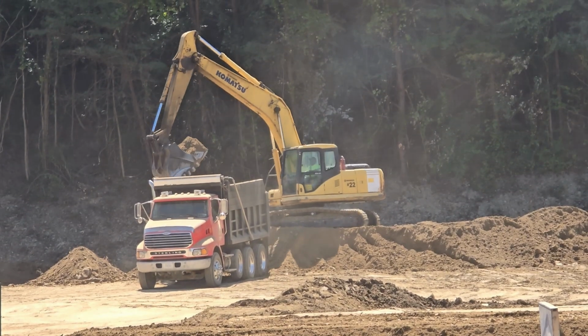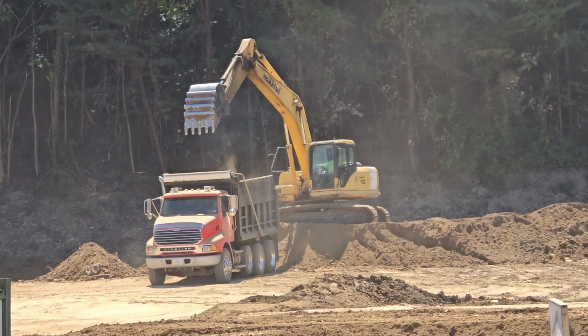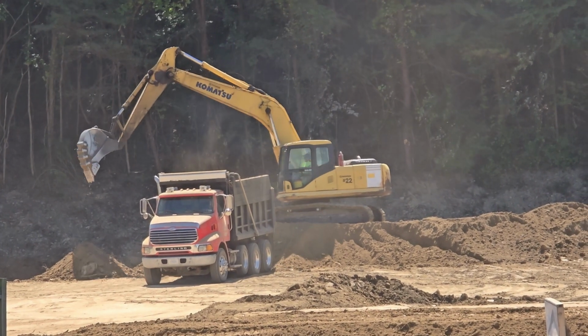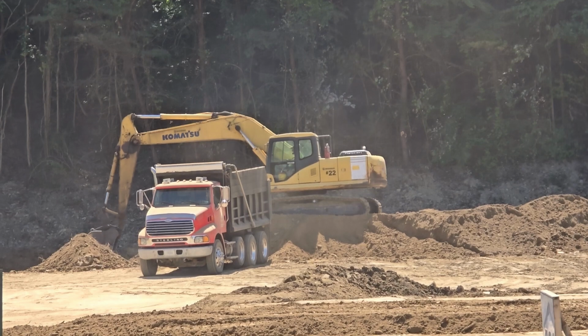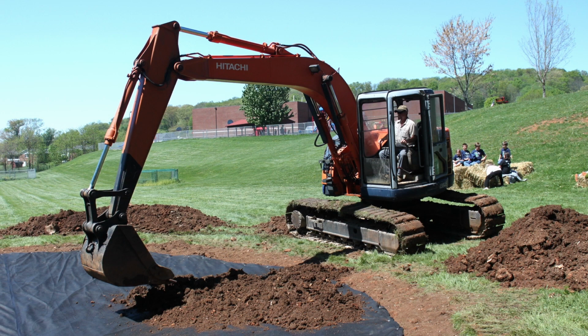If clay texture soil is not present or adjacent to the area where you want to build a wetland, one must find a source for the clay, pay someone to load it, and then haul it to your site using dump trucks. Before the clay is delivered, you should prepare the site by excavating the basin and spreading the soil removed from digging the basin. Seriously consider building the wetland using the aquatic safe liner technique instead of hauling in clay. Transporting clay to the work site and then having to haul away permeable soil would make the project very expensive.